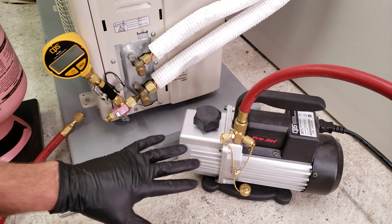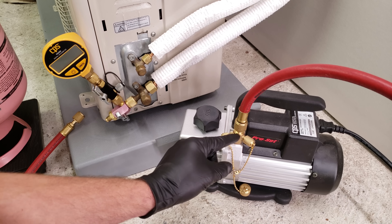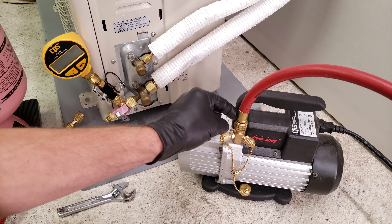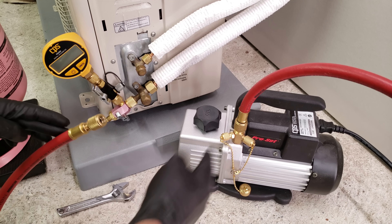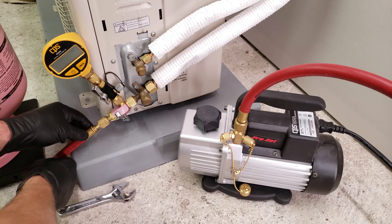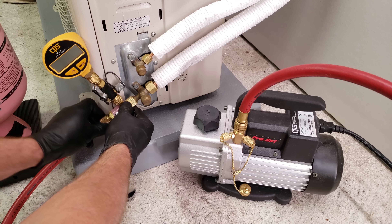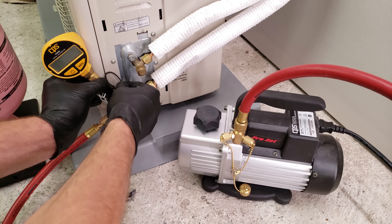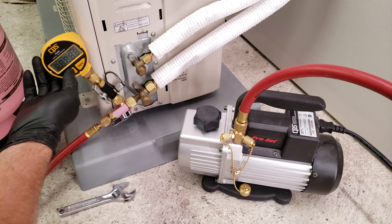This is a 4 CFM vacuum pump — and just so you know, all the tools used in this video are linked down in the description section below. We're going to leave these two caps on and just remove this top cap. We're going to install a 3/8 vacuum hose — this side has 3/8 and this side has 3/8 to quarter-inch. You could use a standard quarter-inch hose or a 3/8 hose with two quarter-inch connections. We're going to connect right onto this end of the valve core removal tool, making sure all connections are snug before we start the vacuum pump.